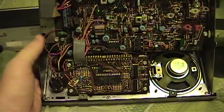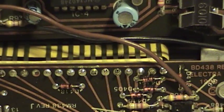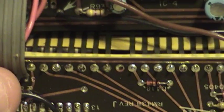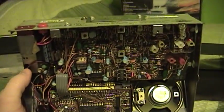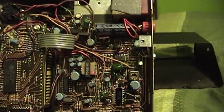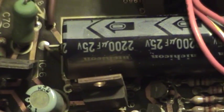That brings me to the second common problem with these radios. Since they are completely assembled by hand, you can see that the quality of the solder joints varies quite a bit. One of the things that causes trouble in these radios after some time — or in some cases even back when they were brand new — is bad soldering. You can see that there is definitely some indication that the soldering joints on the display module are not all that good. There are other component failures known in these radios, especially after some 30-odd years of use. Sometimes they need to be recapped, and you can see that this one's probably got at least one capacitor that has been stressed over its lifetime. There's a little transistor-type voltage regulator there, and it was leaned up against that filter cap, leaving a discoloration mark on it. I may have to replace that in the near future.